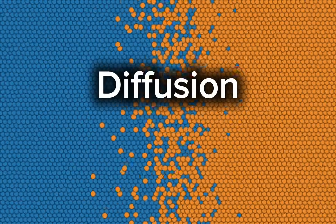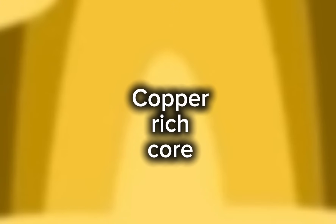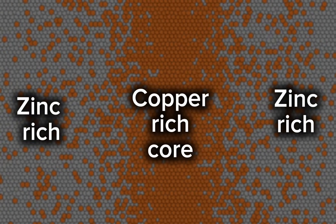The differences between all of these ingots can be simply explained by diffusion. We know that dendrites have very copper-rich cores and zinc-rich exteriors. However, this concentration gradient is not permanent. At high enough temperatures, zinc will diffuse into the copper-rich region, and copper will diffuse into the zinc-rich region. This means that the longer we hold at these high temperatures, the more we lose this concentration gradient. The air-cooled ingot has a very sharp concentration gradient because there is hardly any time at temperature for these species to diffuse into one another, leaving a very sharp concentration gradient that etches really well. Also, we are solidifying quicker, so there's less time to grow larger dendrites and larger grains.